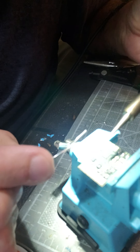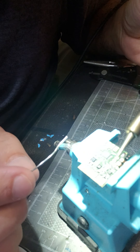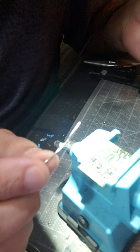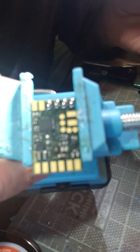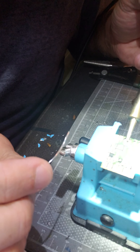What I like to do is I like to go in an outward motion for these NeoPixels. I'm not going to use these connections, but you can actually solder these connections if you wish. What I'm going to do for my NeoPixel parallel and all that — I'm just going to solder straight through. I like to just lay it and pull the solder in. Okay, nice and clean. Let's do the other connections — I like to cover the whole gold contact parts.